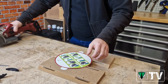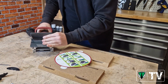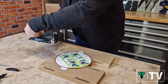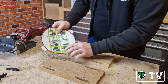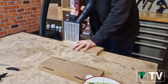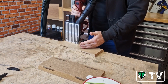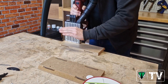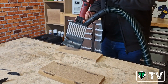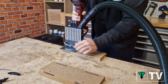So we put the fence that comes with the machine onto the front of the Zeta and remove the 4mm packer we used previously. We slide on this fence and set it to 39mm on the scale, then lock it off. It also shows you a second fence — the reason for this is you could simply use the machine up against the front and plunge, but you have the possibility of some rocking motion. So for extra stability, you can purchase an additional fence. We'll pop one on — that just gives us something extra to hold on to, makes sure we're nice and square so when we do this plunge it's perfectly square. I've popped on the extra fence, so once I put the machine up onto the material, I've got an extra place for my hand to make sure it's all secure before we do our cuts. I'll go ahead and turn the machine on.